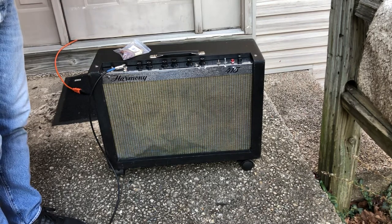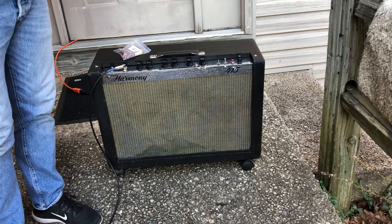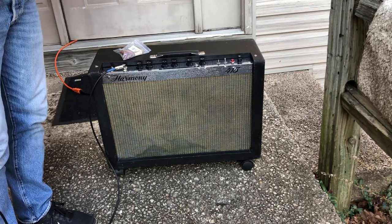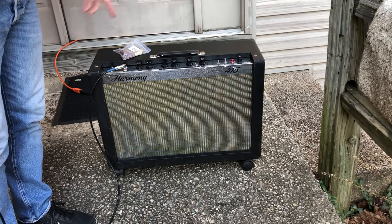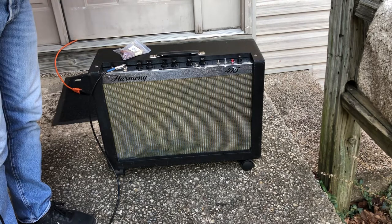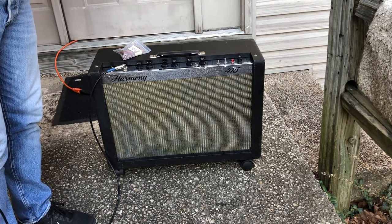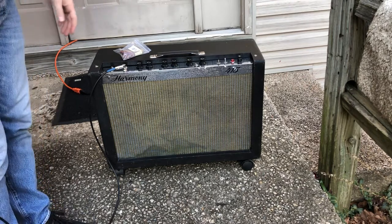It's a fantastic amp and it gets super loud. When you crank this thing — if you don't have a girlfriend sleeping on third shift — it really is like a Blues Breaker. It sounds really good with humbuckers; probably one of my favorite amps. Ken Fisher said this is one of his sleeper amps. It runs 2x EL84s, a 5Y3 rectifier, a 6AU6 for phase inversion, and two 12AX7s in the preamp. All the original Harmony tubes test good, and the filter caps all tested within value with low voltage loss.